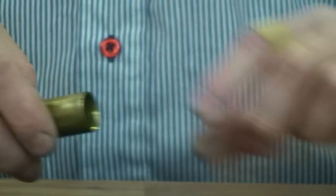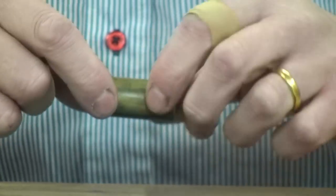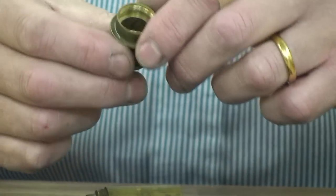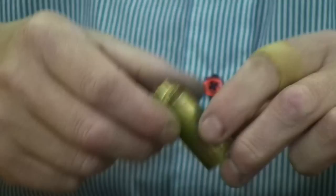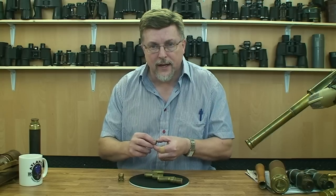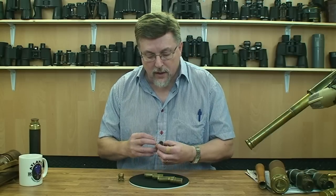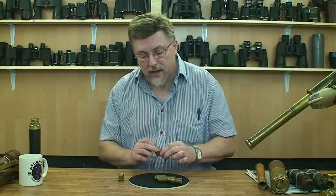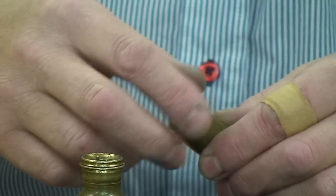Let's put them in order so we can put it all back together again. It's all beautifully turned and fits together as well now as it did then. There's the eyepiece cap — quite nicely made — and this piece actually unscrews, though it's a little on the tight side so I won't take that apart. We can see the eyepiece element on the end. One of the things that always impresses me is they really did intend that the user might want to clean the instrument themselves — every part has a knurled edge to help you disassemble it. We've also got a field stop built into this eyepiece. This is the eye lens, and then we have a field lens coupled with that.